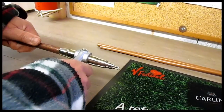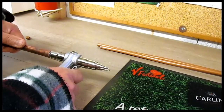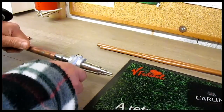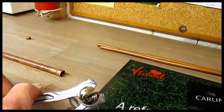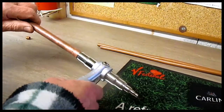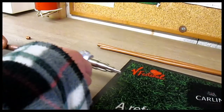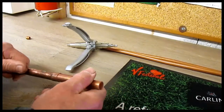It's quite easy as well - I'm using the bench to push against. There's no real strength involved and it's forming nice and quick. You need to understand that you're going around slowly, because if I show you the action that's just causing a V-type of thing. So if you just did that, you're only opening out a small amount. You've got to turn it as you squeeze, and this is causing the socket to form. I'm quite impressed really with the 15mm - that seems to be going quite well. So that's perfect.